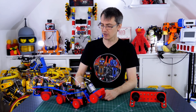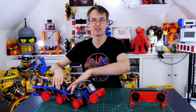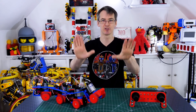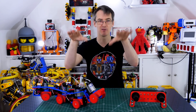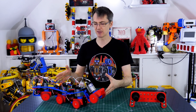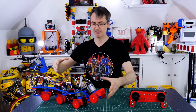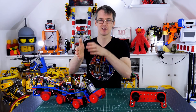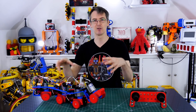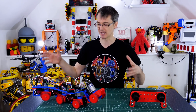What I'd really like to do is make a bigger one of these that I can ride on — a bit like a quad bike where you sit on the middle two sections and the whole thing snakes to steer and bends up to go over obstacles and mold to the terrain. I think we'd have to do something slightly different with the steering rather than bending the whole thing — probably steering in segments one at a time as they approach the same point, a bit like a train going around a track, to avoid too much friction on the wheels. We'd probably need a differential on each stage as well if it's that big.